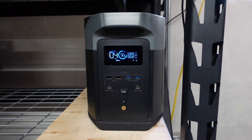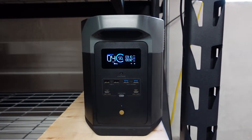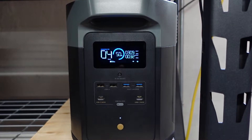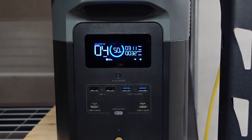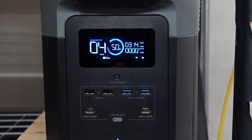The time is now 11:35 AM, mid-August, and I have about 50% charge on the EcoFlow Delta Max. I have all three portable 200-watt solar panels installed in series and I'm getting about 300 watts of input. I'm going to go back outside to better optimize these solar panels to face the sun, doing that periodically over the course of the day to get the best input and see how long I can keep the refrigerator and freezer running.